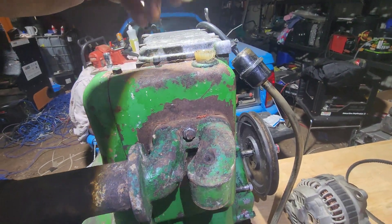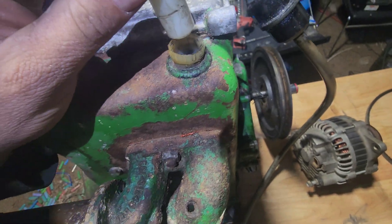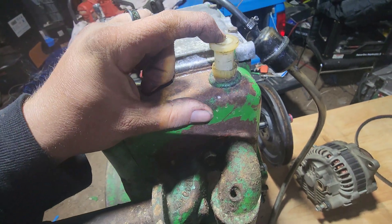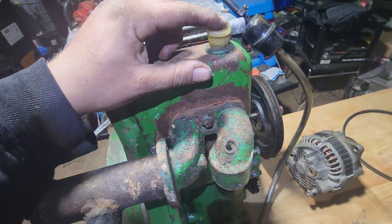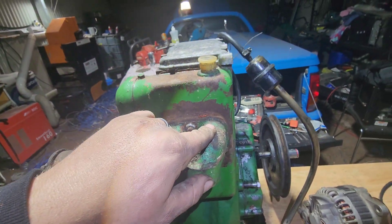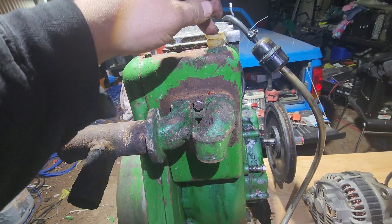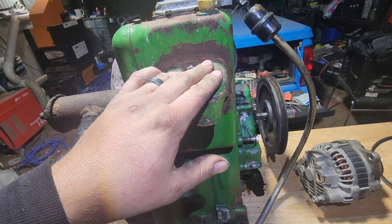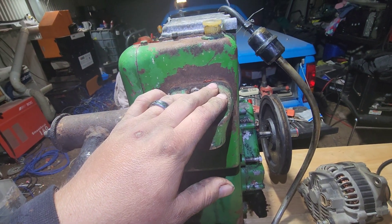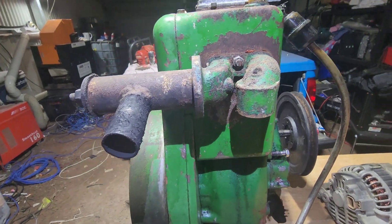It runs on recycled fuel. This little thing here — you put a bit of oil in that, give it a squeeze while cranking, and it pushes whatever you put in there into the cylinder. A few things I've seen people use in that: mineral turpentine is good, it'll get it to fire quicker and easier on a freezing cold day. But this has tons of compression, so starting isn't an issue at all.